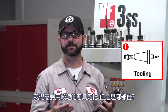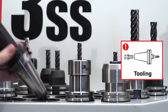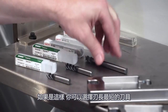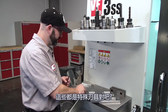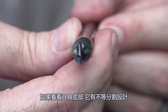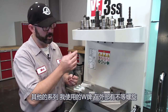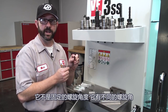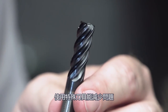Typically, if we want to dampen vibration when it comes to our tooling, we want to shorten up those tools — our holders, our flute length, everything you can. Sometimes you have no choice; you've got a deep pocket you have to machine. In that case, go with the shortest flute length possible — a solid carbide tool that only has the flutes necessary for the pocket you need to create. Some unique tools have variable flute spacing, which interrupts the cut and cuts down on chatter. Along these same lines, the end mill used along the outside of our part has a variable helix and variable pitch teeth — variable flute. These interruptions in the cut keep us from finding a sweet spot where things tend to chatter.